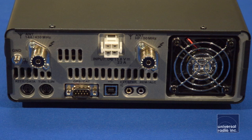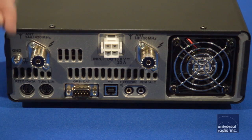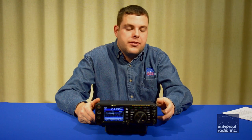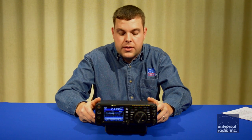I wanted to show you the rear panel to highlight some of the connections. The chassis is one big piece of aluminum with a fan on the back to draw air through and keep it cool. You've got an HF connection covering 160 through 6 meters — that's where the antenna tuner connects — and a separate connection for your 2 meter and 440 band, so you can connect two different antenna systems. There are separate jacks for external speakers, data out, a serial port, and a USB port. The USB connects to a GPS for APRS and position locating, and it makes it very easy to interface with a computer for software control and logging.